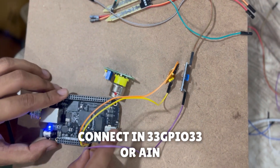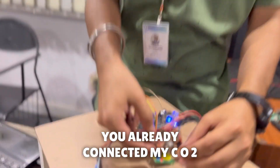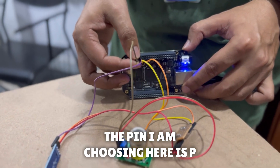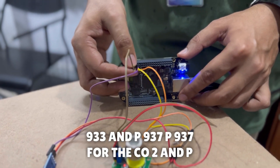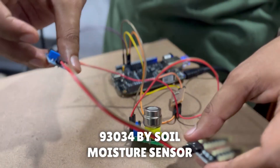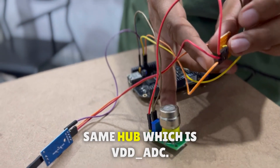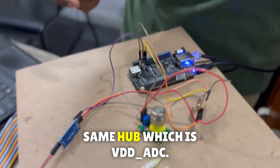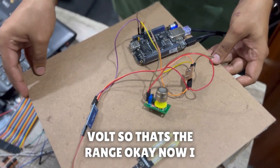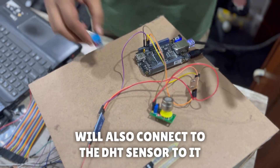I've already connected my CO2 sensor and soil moisture sensor. The pins I'm using are P9_33 for the soil moisture sensor and P9_37 for the CO2 sensor. Both are connected to the same power hub which is VDD_ADC, providing up to 1.8 volts — that's the operating range.